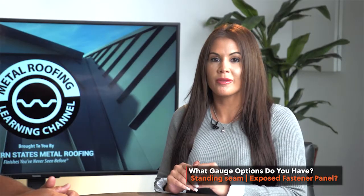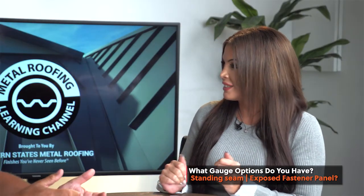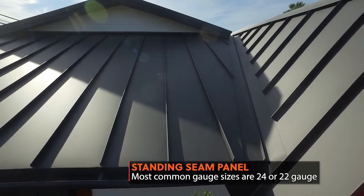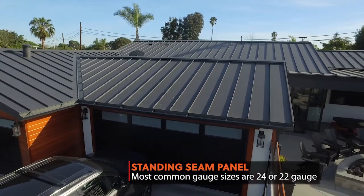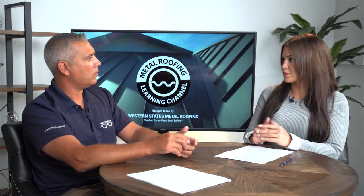As we mentioned, there are a few choices you're going to have to make when choosing your metal panels. Gauge is actually the last choice you make. The reason it's the last choice is because depending on the style of panel and the paint finish or color, your choice might actually be made for you. For example, if you want a concealed fastener panel such as a standing seam or a flush wall panel, those panels are only available in a 24 gauge with a Kynar paint finish. So if you're going to put a standing seam roof on your house, you're going to be going with a 24 gauge panel, possibly a 22 gauge panel. There are a lot more options with exposed fastener panels for gauge — you can go as light as 29 gauge and as heavy as 20 gauge.